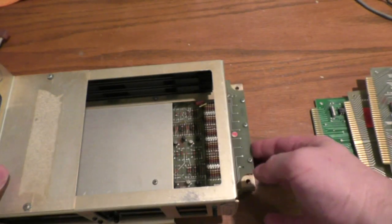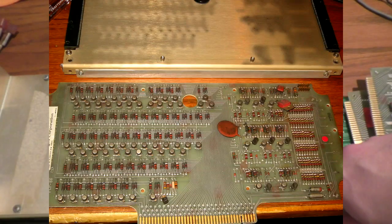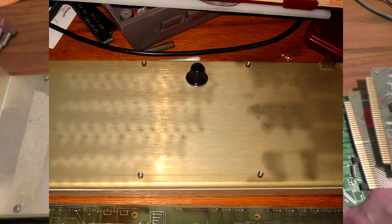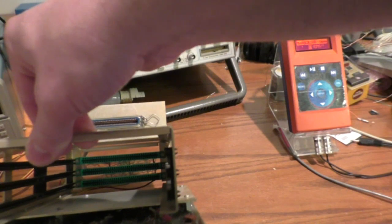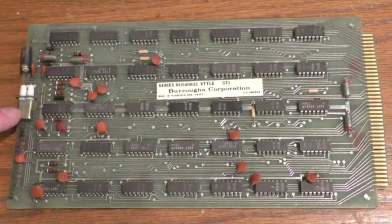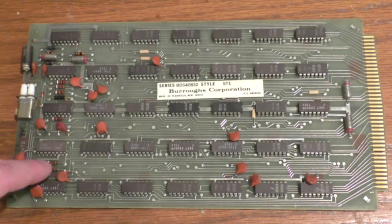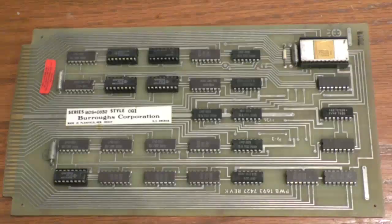The boards are out; you can see some of the driver board. I'll show a picture of what it actually looks like — I had this apart when I got it and cleaned everything. This is what the back of the display looks like; it's glued into the metal frame so it's not really removable. Inside the cage there are just some connectors and then the bottom board, which has a 4 MHz crystal doing all the timing. This board is basically the X-Y timing control — it has all the counters, generates the cursor, and controls all timing and control signals.